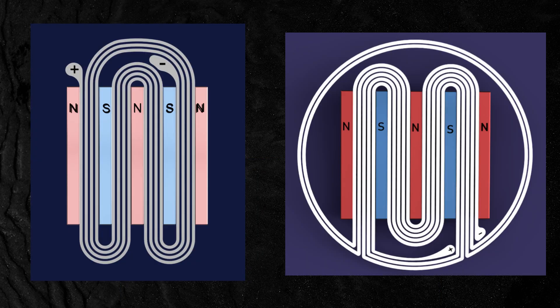The voice coil — a conductive trace — runs serpentine through a homogeneous magnetic field created by neodymium magnets. When it comes to these membranes, depending on what characteristic you're looking for: if you are looking for a treble-focused driver you should be doing smaller membranes, but if you want a full range response from your drivers you're going to want to maximize the size of your membrane.